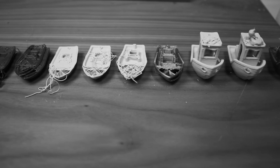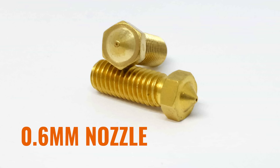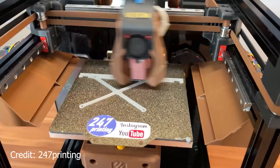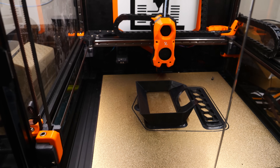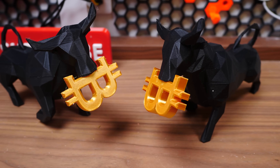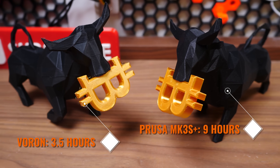A few days later, I found a few hours to do some tuning and tweaking, printing failed Benchy after failed Benchy, and eventually — thanks to Albert — I was able to get my first sub-21-minute Benchy using a 0.4mm nozzle. I'm sure that when I switch to a 0.6mm nozzle and apply the settings Albert sent me more recently, I'll be printing 15–16 minute Benchys in no time. I've just been blown away by how fast it prints and how much better the quality is than even my slower printers.